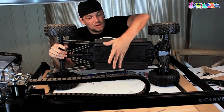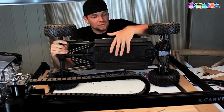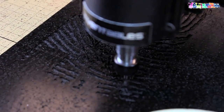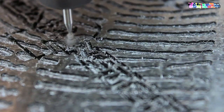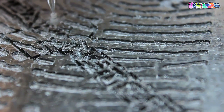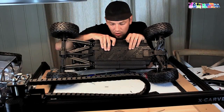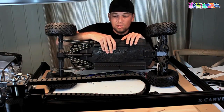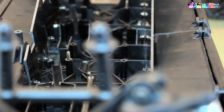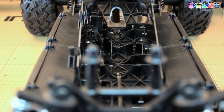The next drawings were all the logos, machined diagonally just to make sure the actual split — which is a 90-degree split — is as strong as possible, because I don't want any problems with the car falling apart when I eventually run it. You can leave the logos out if you don't like them. Then I machined the entire outline of the chassis plate — that's also a separate file, so in theory you can just use the outline for your part and be done. I made a separate file with all the holes, and another separate file in which I countersunk all of the holes. Figuring out where these holes needed to be was the most work — on the inside there's a whole lot of webbing going on, and I wanted to make sure I missed all of it.